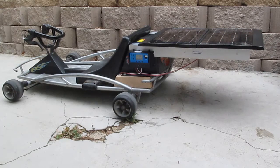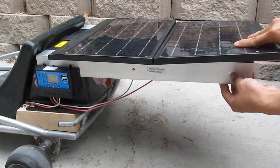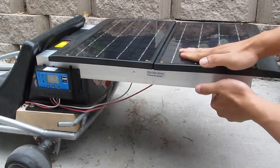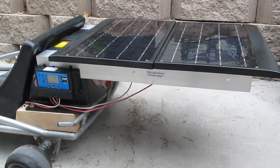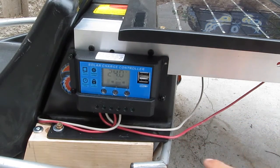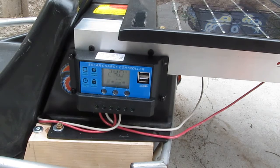I've got two solar panels on the back — each panel is 12 volts, so the two panels are connected in series to produce 24 volts. I mounted the solar panels using Velcro — stick them on and they're not going anywhere. Looking at the charge controller now, everything is connected. The blinking arrow means it's charging the battery, and right now the battery is at 24 volts, so with this LCD screen I'll know exactly the state of charge at all times.